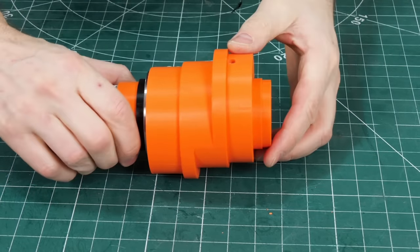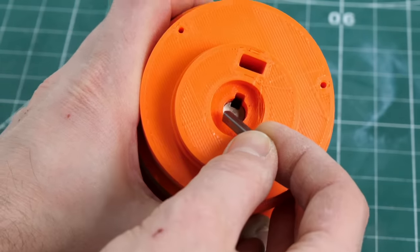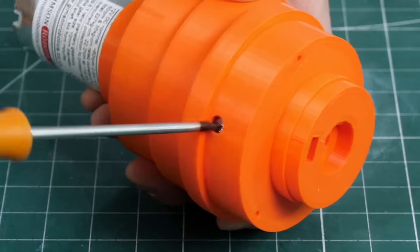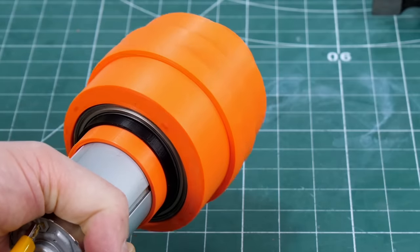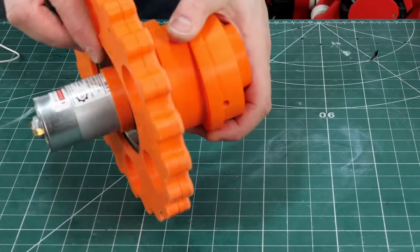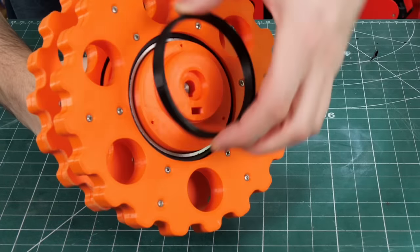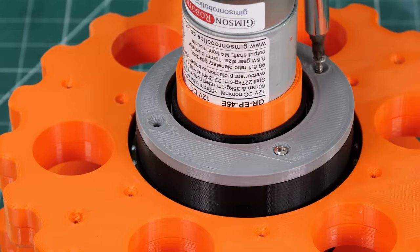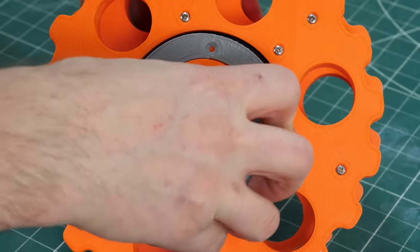It's a bit of a push to get the motor through the 10 millimetre hole in the end. There's a keyed shaft that's going to fit in there — just a standard piece of 4 millimetre key — and then there's a grub screw and a captive nut so I can screw that in and hold it in place so it won't slip off the motor. Now the cam rotates around the motor; I've had to leave some sticking out so I can actually hold the motor since the mountings are inside the cam. Those cycloidal discs go on with those big bearings, and that gives us our two rotating cams with collars and retainers to hold them in place on the back and the front.